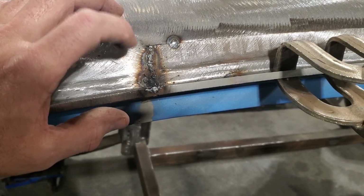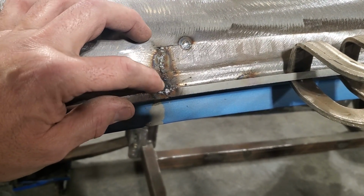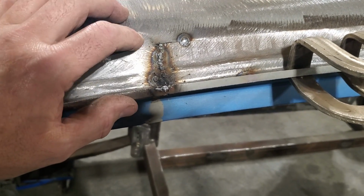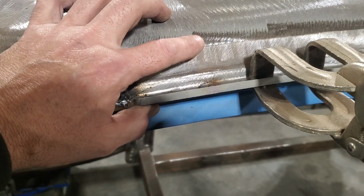I had a hard time welding this here. I had to turn the welder right down in order to try to weld it. It just kept blowing holes, and I got a big section right here that I blew holes in, so I just had to weld it all up solid. You could be at that all day. That's the reason why I was not fussy on doing any butt welding up here.